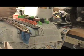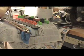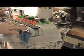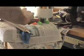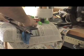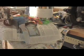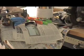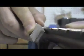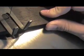Now applying the glue, and I'm going to let that sit overnight after clamping it very well to the neck. And this fretboard was previously aligned with locator pins to meet up on the neck just where you want it. There's one look before shaving down the excess on the frets. It actually does very little scratching on the fretboard, as you might think.